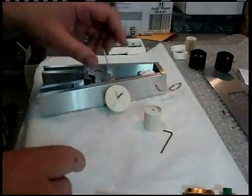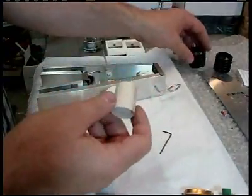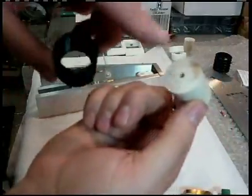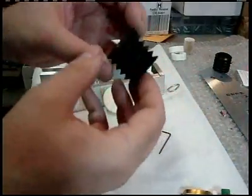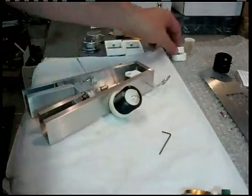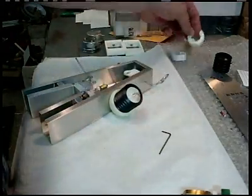While we're waiting for the switches to dry, I can show you a little bit more on the arm assembly. For example, inside the bellows, because they're not really meant to be load supporting, we're going to put in this piece of wood dowel. I do cut these and drill the hole through the center of them on the lathe. And basically the wood dowel fits in there, and the whole thing slides on that 632, and then of course the claw screws onto the threads.